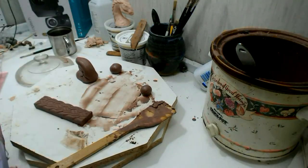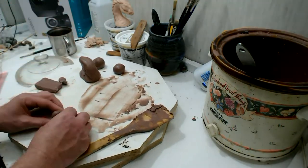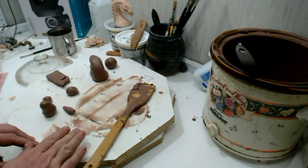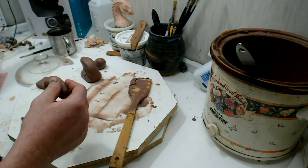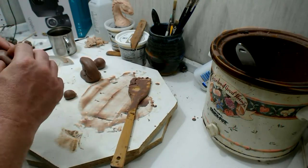What I've got there first is a mold that I have specifically to cast this clay. Monster clay is a wax-based clay, so it is able to be melted. It will never really harden, which is great for modeling because you can reuse it over and over again. And once you have that initial investment, you're for the most part pretty much done.